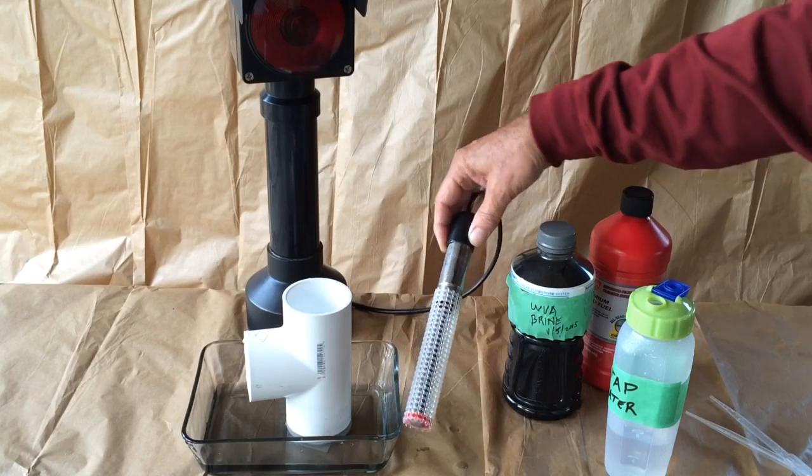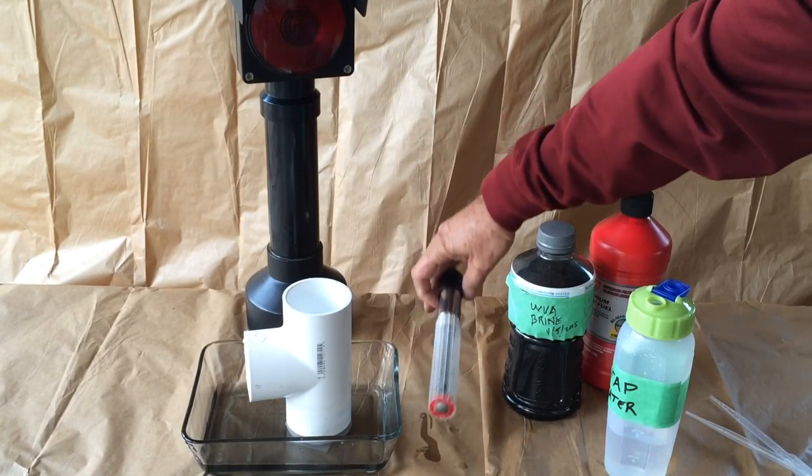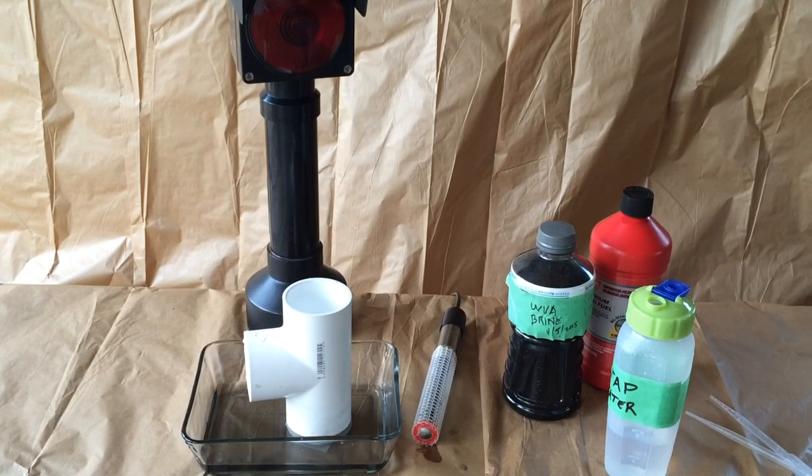So that's the TRM-CB sensor. It's available in two versions. The version that we demonstrated here this morning is designed to work with this flasher type unit. There is also a relay version if you want to have some sort of connection to a PLC or remote monitoring system, and the performance is identical. It ignores rainwater or condensation or snowmelt, and responds to either produced water or to oil or other hydrocarbons.